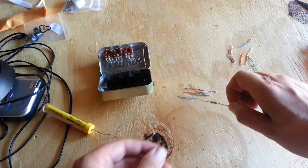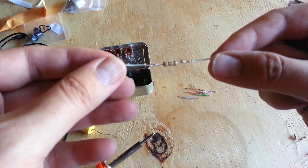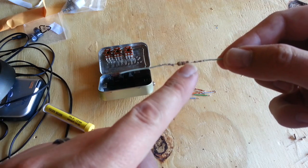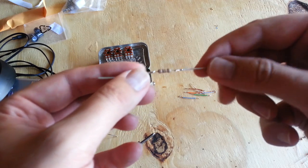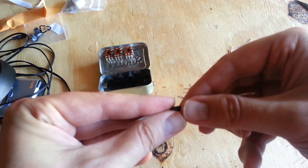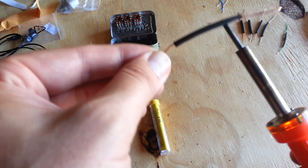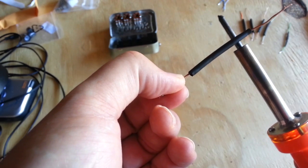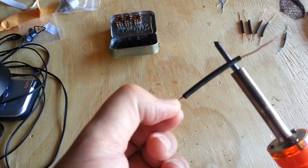The six wires running from the input jacks to the potentiometers have been made. Now I'm making the wires running from the potentiometer back to the output. This is significant because there is a 1k resistor in-line, so you need to solder that in. Make sure those joints are good, with enough wire that things can bend around. We'll be putting a piece of shrink wrap on this to keep the resistor away from the lid and prevent shorts. I'm shrinking the wrap with a soldering iron out in the garage since the wife is asleep — not the best technique but it works.